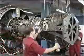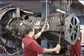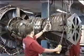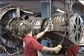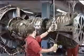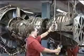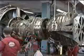It's now possible to pull the LP turbine module out of the engine, taking care that no fouls occur. Move the module rearwards about 20 inches. At this stage, it will be necessary to fit the guide sleeves to the rear of the high-pressure turbine.